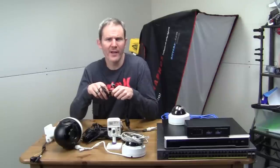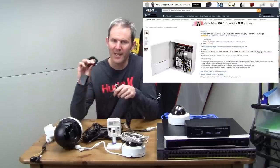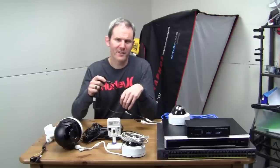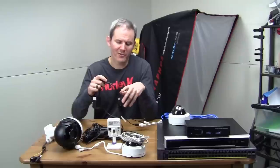You can take this further by adding a power supply unit — a power box where you can plug in multiple power cords at once without bulky adapters; you simply wire the 12 volt connections in. A power supply box plugs into one outlet and powers all your cameras at once. The main advantage of an injector and splitter is the price, but the disadvantage is messy wires around your power source and a splitter at each camera — extra hardware to tuck away and protect from the weather.